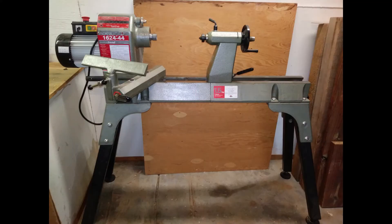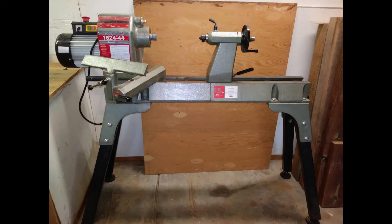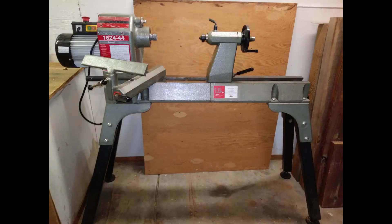When I got it, I didn't know that all these parts came off, or even where it was obvious, I either lacked the tools or the confidence to put it back together correctly. Since I wasn't familiar with the lathe yet, it wouldn't have mattered anyway. Remember, 7th grade woodshop is the most exposure I've had to tools. So I had to move it as one giant piece, aside from the legs. This posed a problem putting it back together, because the design requires that the swivel head be mounted before the legs could be put on, because of the headstock release handle placed in the pocket underneath the swivel head. That's a lot of weight to levitate. I was 140 pounds at the time — this thing outweighed me more than 3 to 1 — and I'm kind of proud I was able to get it back together on my own. It really does all have to be lifted at once to get the legs on, and I had to use a system of ropes and pulleys to make that happen.